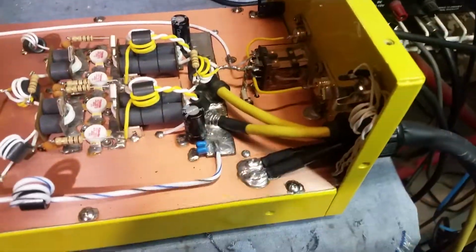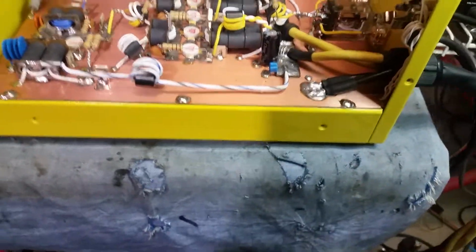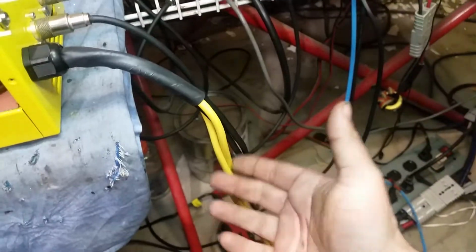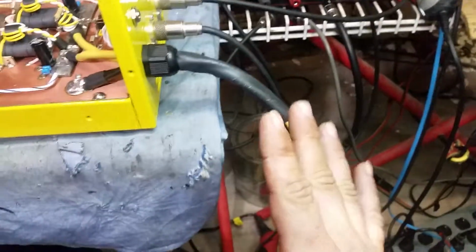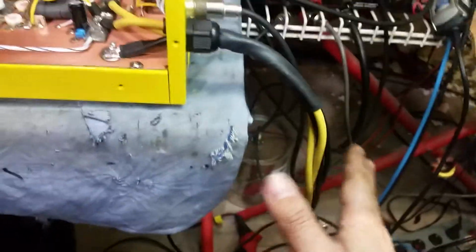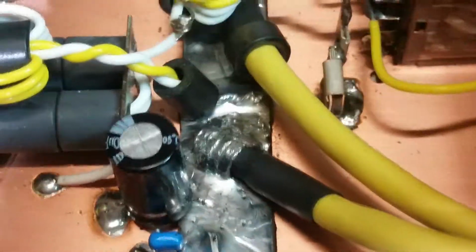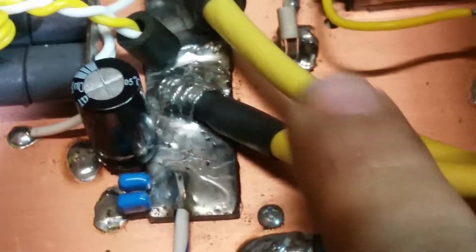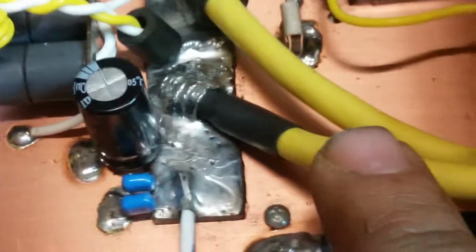We got you two 8-gauge wires on this bad boy to match the color code for you. This is actually copper clad aluminum wire, and you got to take a little bit extra special care when soldering that type of wire. As you can see, let me show you right here on the hot bus. The thing about this is there's probably about 20% copper in this, and the rest of it's pretty much a type of aluminum.